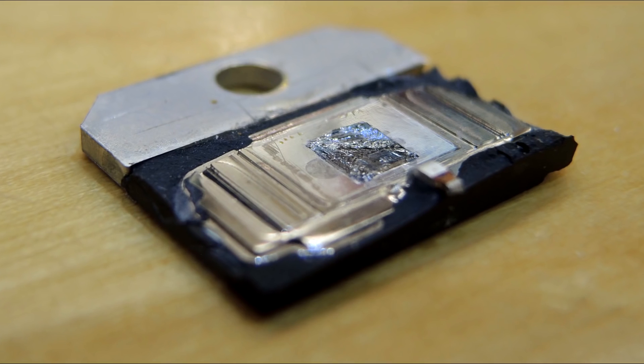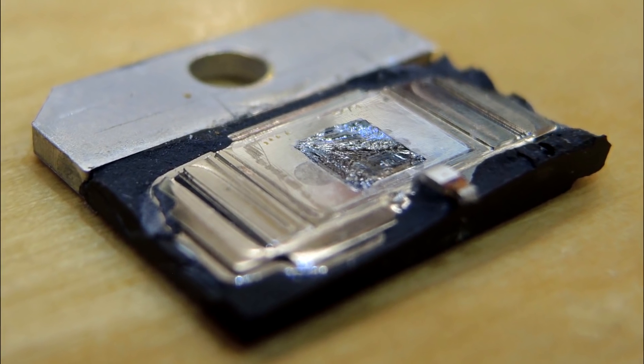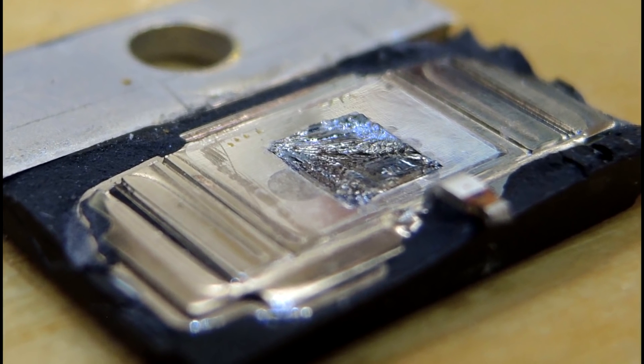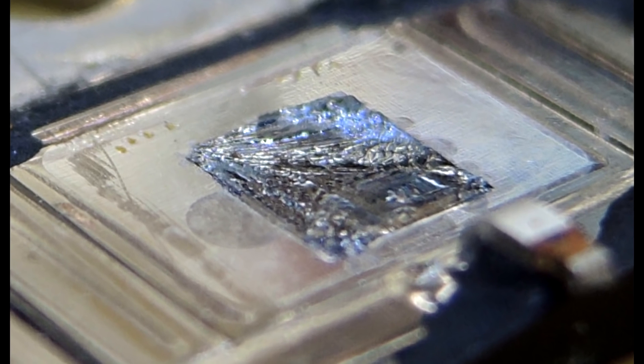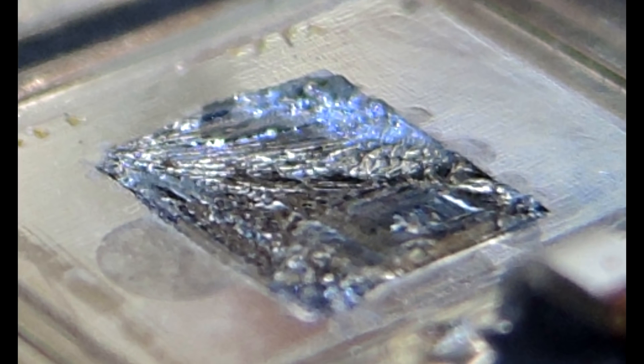Here's another picture. I've taken the actual assembly and I took a chisel to it. I knocked the top off which contains the silicon die. What I'm left with is the metal plate, and in the center there is actually a little bit of the die left — it fortunately cleaved off cleanly. What would have happened in the packaging is that the lead frame is above that in the actual epoxy.